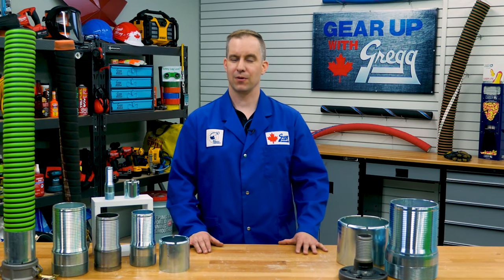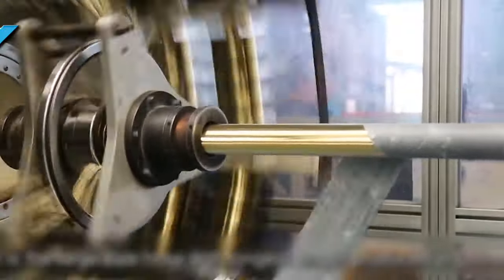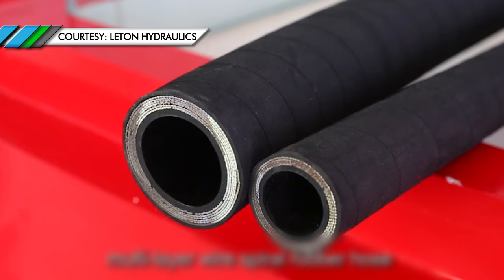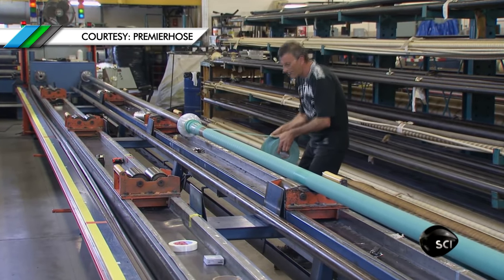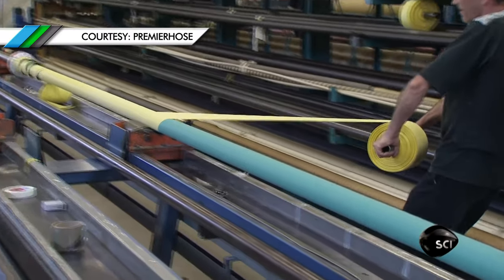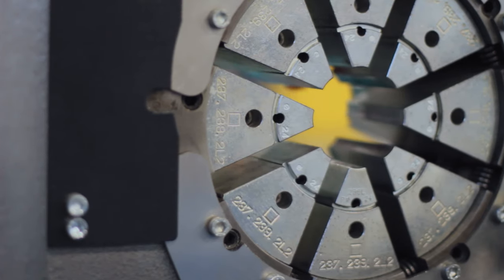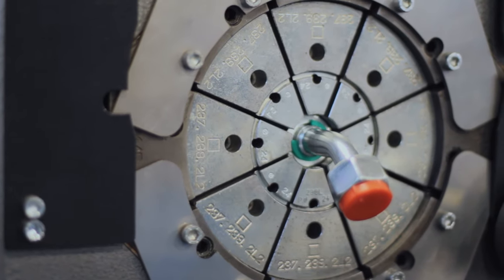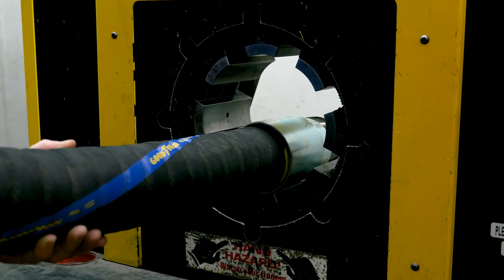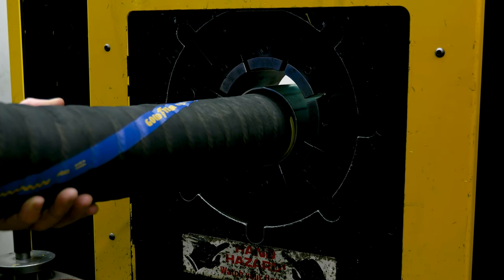What exactly is Campbell Crimpenology? Unlike hydraulic hose that is machine-made and retains a consistent outside diameter throughout its length, industrial hose is exactly the opposite. Industrial hose is hand-built and will have a different outside diameter measurement throughout the length of the hose, and this makes crimping industrial hose that much trickier. On a hydraulic hose, both ends within the same size using the same fittings will have the exact same crimp diameter. More than likely with an industrial hose, every end you crimp within the same size with the same fittings will have a different crimp diameter.